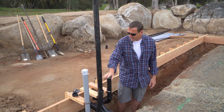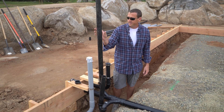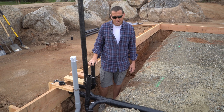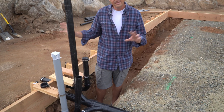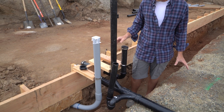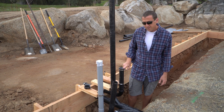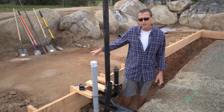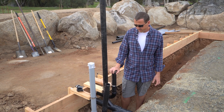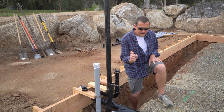So that's the floor drain. This one is the fresh water coming in. This one's going to be the vent pipe. This one is for our gray water drain - the washer can actually drain out to the landscape so you can reuse the water. But you need to have an alternate, so there'll be a p-trap on here and we can drain it through the septic system, or drain it out the other way to the landscape. That's how our washing machine will hook up.